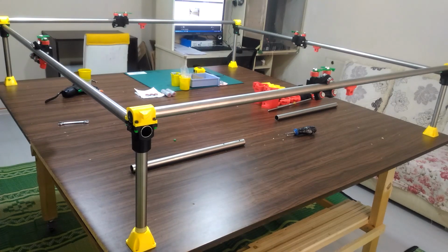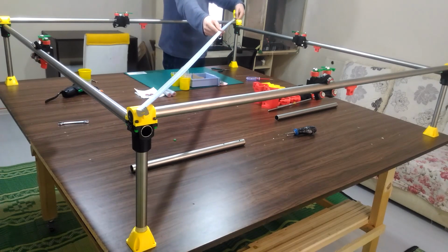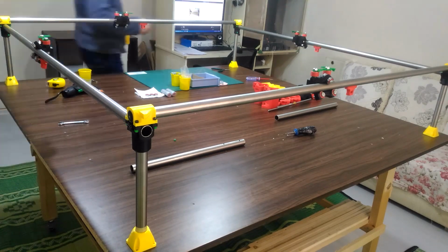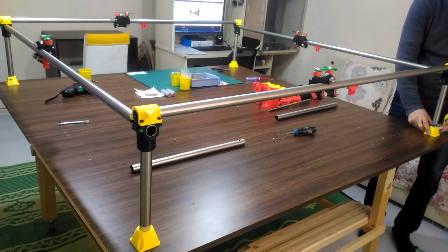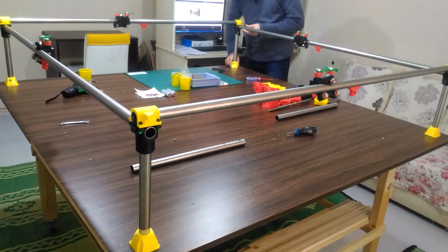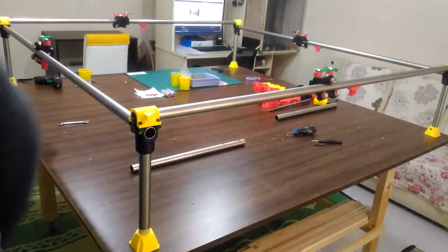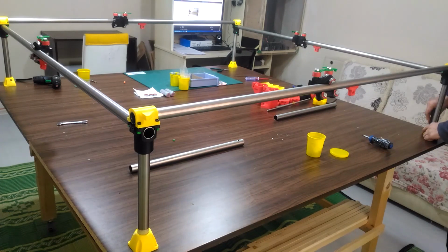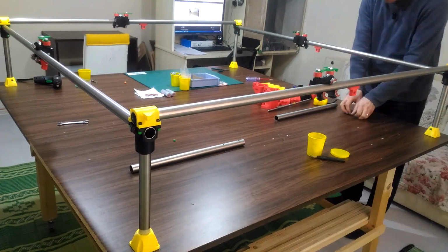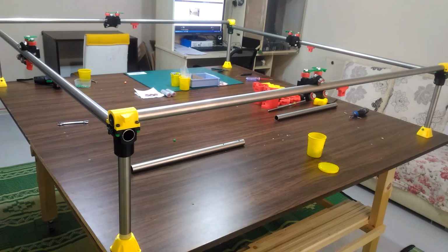We can nail the legs to the table at this point to ensure that the machine stays firm and stable while we control the perpendicularity. First, fix two legs to the table, and depending on them do the measurements and fix the other two. Of course, take your time and make it as accurate as possible. We are going to do the controlling of the frame and perpendicularity later after assembling the center gantry.